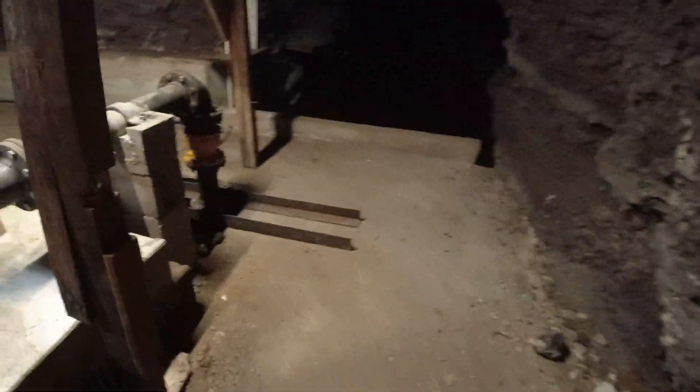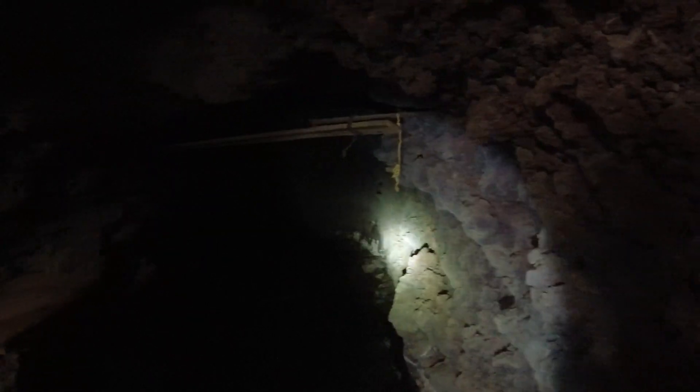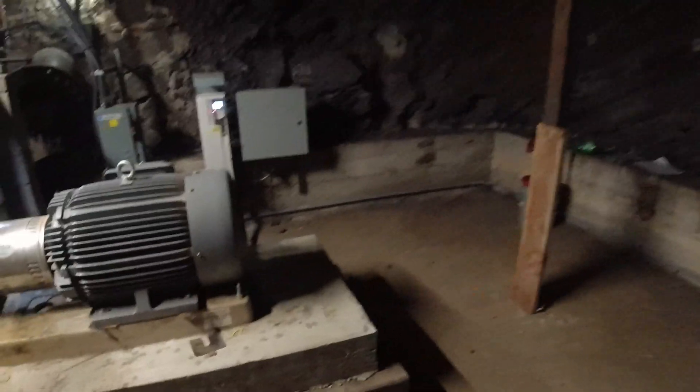Here's our pump room - pretty basic. Here's the actual skimming well that I mentioned. You can see the water table right there - if they kept digging any deeper they'd reach salt water. But here at this depth there's fresh water floating on top of it. The tunnel goes for another maybe 75 to 100 feet and then curves to the right in a slight spiral, just to increase the surface area that they can skim the fresh water off.